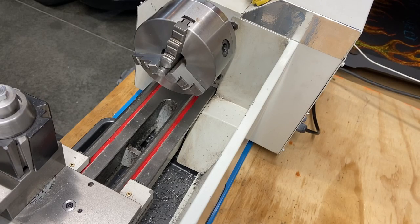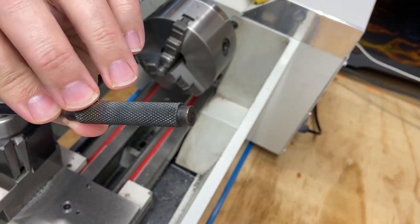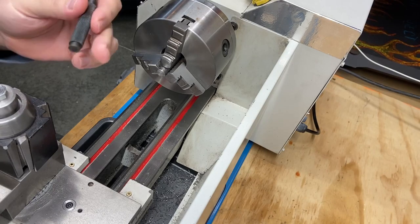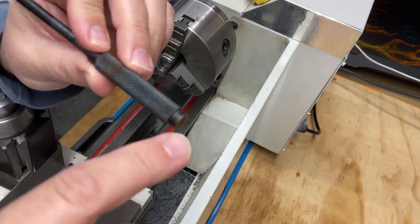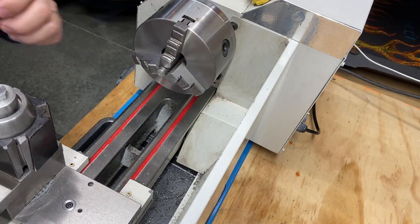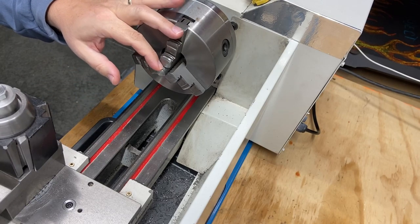Welcome back. I'm going to continue on with the recreation of my brother's punch. So if you recall, it's been a couple weeks since I started that intro to that video, but the first thing I'm going to do, in order to attempt to knurl where I actually have a diamond pattern, I'm going to drill a center hole here, and that way I can bring it out and get some rigidity for when I'm trying to knurl this piece. I'm not sure how hard this material is.